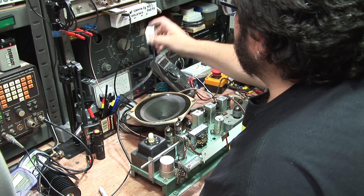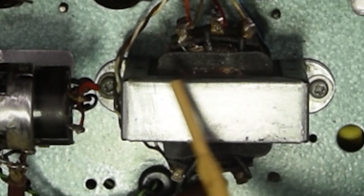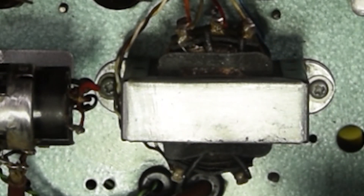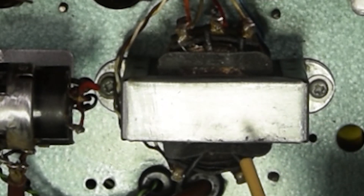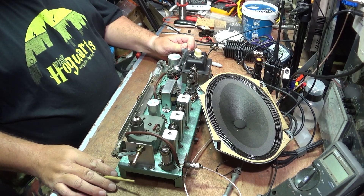I'm going to plug it in again. Now, I'm not on direct mains at the moment — I am on my isolation transformer. One thing that anybody who doesn't know anything about valve radios should know is that if you have an output transformer like this on a radio with exposed terminals, at least two of those terminals will be at around 250 to 300 volts of DC. That's enough to give you a seriously bad day. So if you don't feel comfortable playing with this stuff, let somebody else do it. Just a friendly warning. For those of us who are mad enough to actually like playing with this stuff, let's switch on the live electricity and just let it heat up.